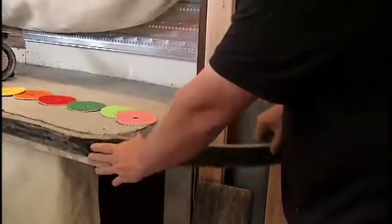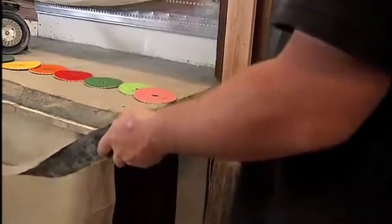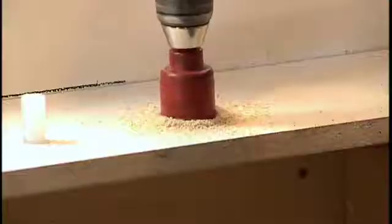And then all this will come off, and all you'll see is the inside of the form. And then to accommodate for the fixtures and so forth, we've got some PVC and tubing in here. Now, does this stay in place, or are we going to pull that out after the concrete's poured? Yeah, these will actually stay in place. We took the templates of the faucet and your soap dispenser, and all the decorative parts will cover up the holes. And we did a lot of taping.